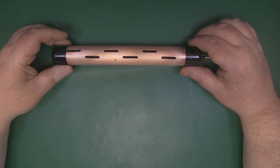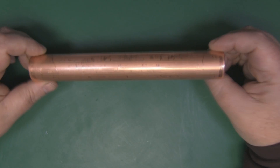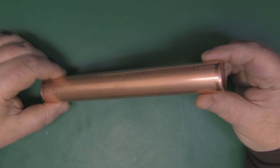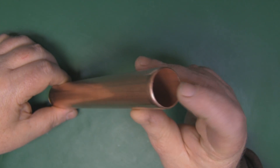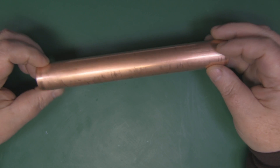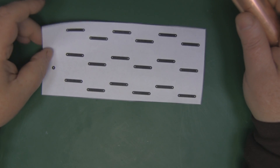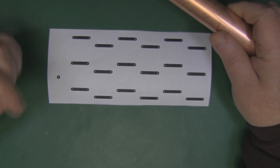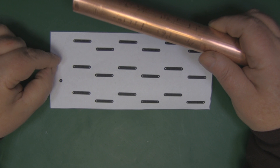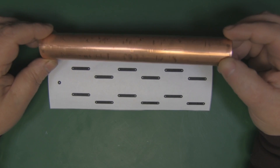To make this antenna you'll need to find some tubing. I've got some copper tubing I picked up off eBay — a meter for less than 10 pounds. This tubing is 28 millimeters in outside diameter, cut down to 200 millimeters in length. You'll need to download the template, print it off, and I'll leave a link in the description. I've made this template specific to the 28 millimeter diameter tubing.